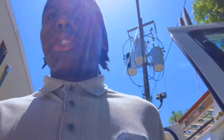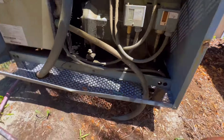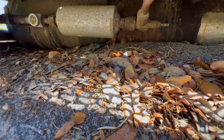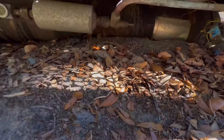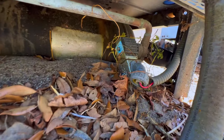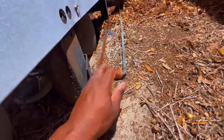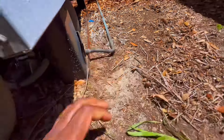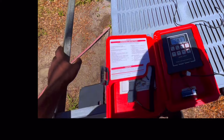I'm probably gonna hook my gauges but I really don't have to. If they don't have a Schrader port where I can just read the pressure going towards that case, I won't bother. But the air feels much cooler now. My sight glass looks pretty clear, which is good. The liquid line feels way much better now — about 88 now compared to the 114 we had.